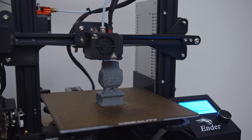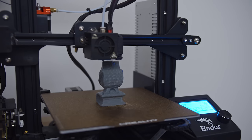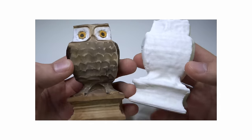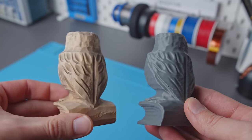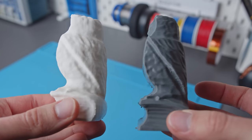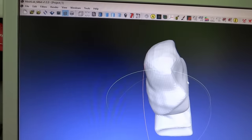There are two things I 3D printed based on the scans from the scanner. The software does a good job making the models watertight, which is very important for 3D printing, but you really need to get nice data during scanning. I printed the owl because I still have the original one and the one printed after scanning with the Cyclo 3D scanner — the first scanner I used a few years ago — so you can compare the differences. The new model has definitely a lot more detail and from all sides it resembles the original owl a lot more. What is not visible is how much easier it was to scan this time — the difference is like 10 minutes of work versus 2 hours and a few different programs required to convert point clouds into an STL file. It's just so much easier now.